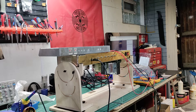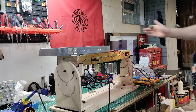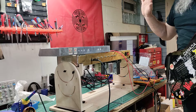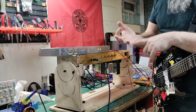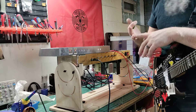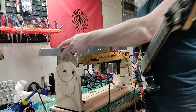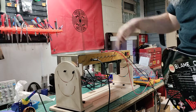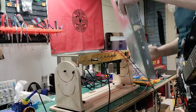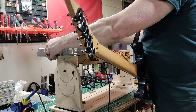Howdy Rich! Here's the skinny. Your 800, she's 100% back to stock. The post-phase inverted master volume bullshit is removed. The effects loop is removed. Replaced a couple of missing components, cleaned up a couple of issues, added some bias resistors on the power tubes.